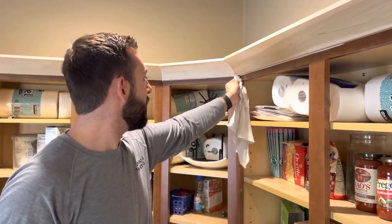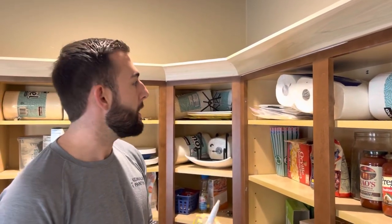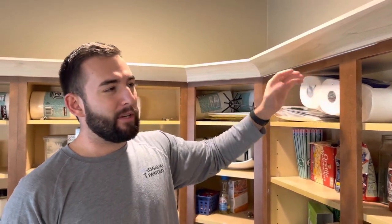Your wet rag is just for areas where you had a little bit too much, just to clean it up. And this way, once we paint it, there won't be any gap — because if we didn't do caulking there'd be kind of like a shadow between the piece of trim and the cabinetry. So this will just give it a really clean look and be ready to go.